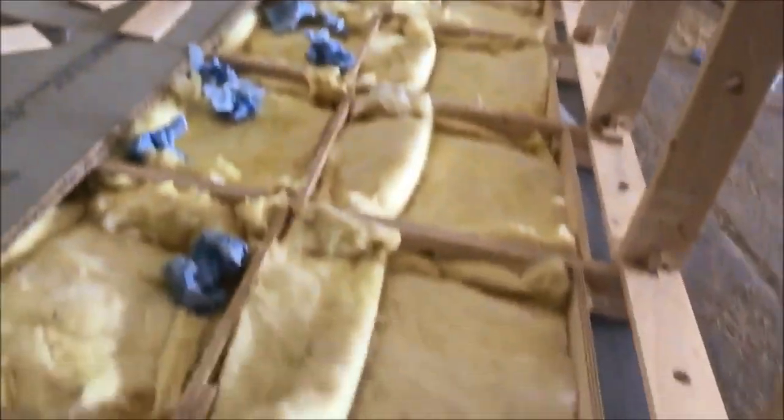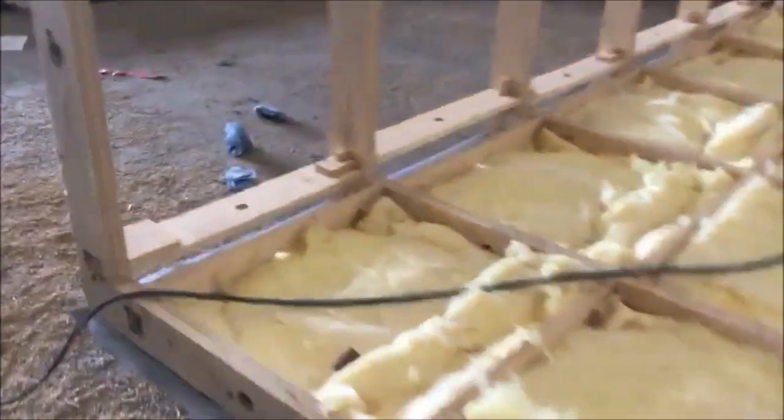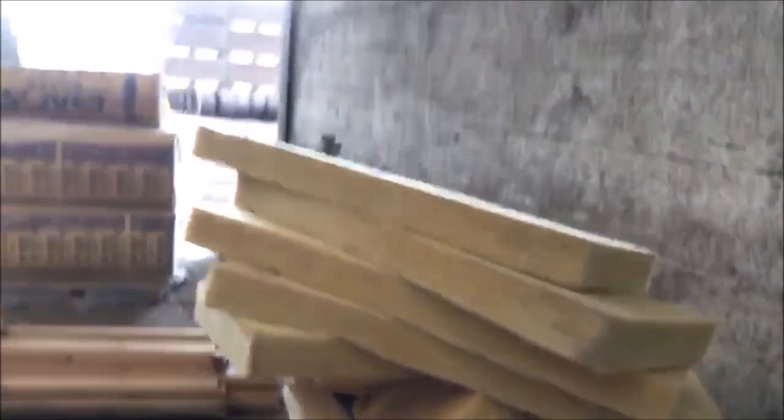Once we have the other piece of chipboard ordered, we've finished all the insulation in the floor. Once I've done this wall as well, I'll start on the pack and the insulation. That will be using the square bits over there. The reason we use that square stuff instead of what's on the floor is it doesn't sink. The rockwool stuff — over time it just sinks in the boxes, so the square stuff just doesn't.